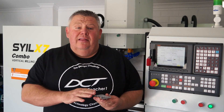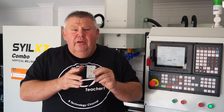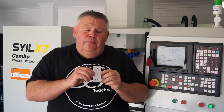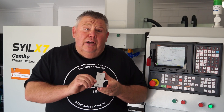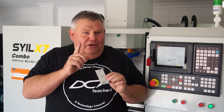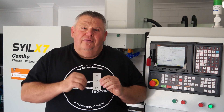I've just pulled the part out of the milling machine and buzzed the hat off that part down to size. I'm going to put the part back in now in the right orientation and pick up that back left corner again off this tidied-up piece of stock. We're going to bore these little holes here — I'm going to use a little 3mm end mill, drop down in that hole and circle interpolate to clean it up. I nearly got caught out because these holes aren't symmetrical. Luckily at the last minute I checked the CAD file and found I had the part flipped the wrong way around. Lesson learned — luckily I didn't stuff it up. Let's take a look at the drop down and bore those holes out.